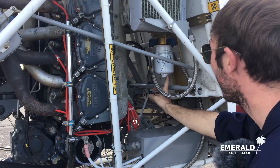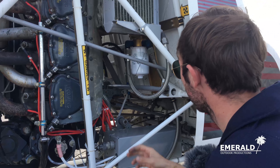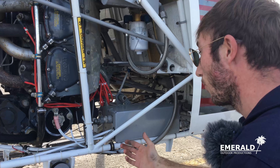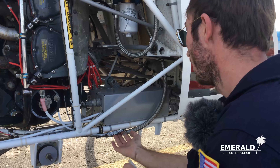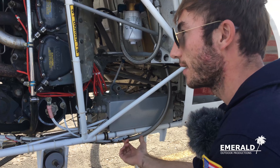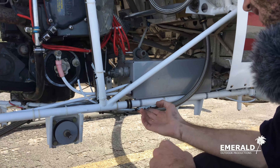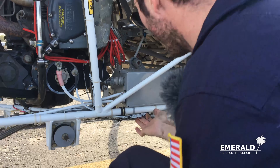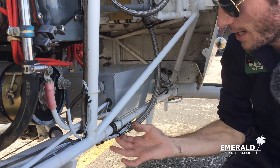We check this side — fuel tank is secured, and there's another petcock to drain here. This petcock actually had a small leak we recently fixed, but I left the evidence for this video. If you look on the bottom you can see it's blued — that is a really good indication of a small leak. The 100LL actually has coloring in it and you can see the blue, so that's a good sign of a leaking petcock, which we've already fixed.